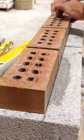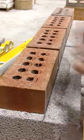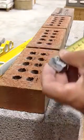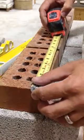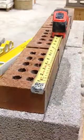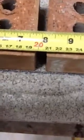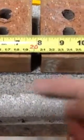Now, the nice thing about imperial measurement when you're going lengthwise is that the edge of every brick to the next brick has to be 8 inches. So if you see right here, it's about 3 eighths — that's actually a little bit off. It depends on the bricks too; some bricks are a little longer, some aren't. I'm going to have to tap that so the 8 inches goes that way a little more.